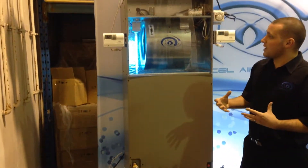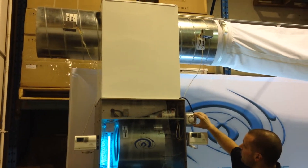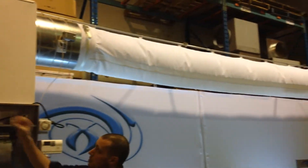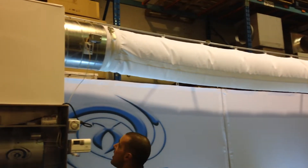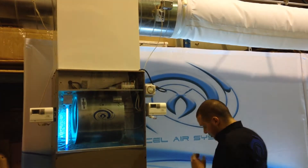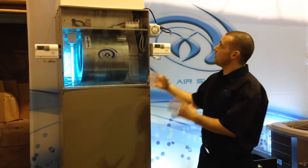When the 12-hour cycle happens, we flip the lights over with your 120-volt flip timer that you purchased, and now the dampers close. The supply and return air dampers close on room A and they open on room B, so now we're able to supply room B with cold air and return the warm air back to the unit. This is the complete damper package.